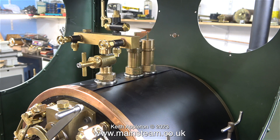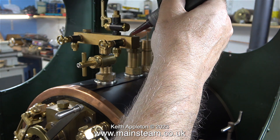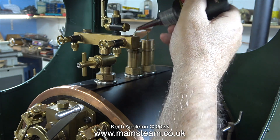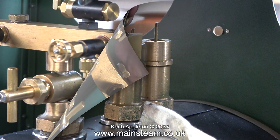I missed something obvious. The original pressure gauge was fastened to the top of the turret with two small 6BA bolts, and I think these holes may just go all the way down into the steam space in the turret. So I coated the holes with thread sealant and screwed in a couple of brass 6BA bolts — the original ones that were in there.